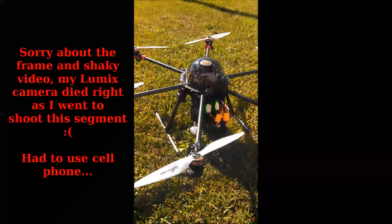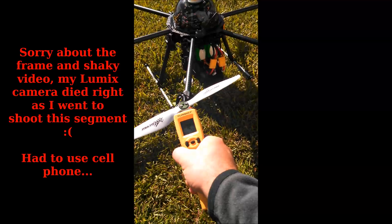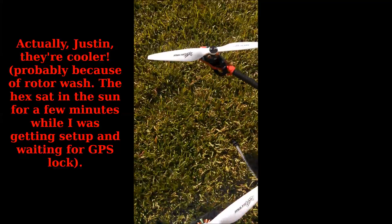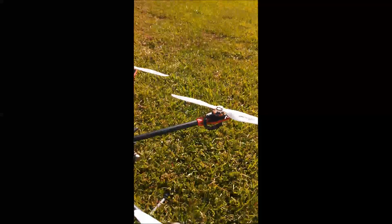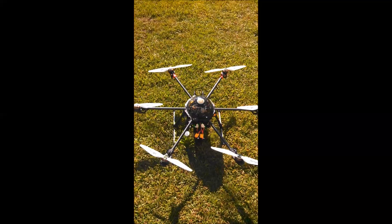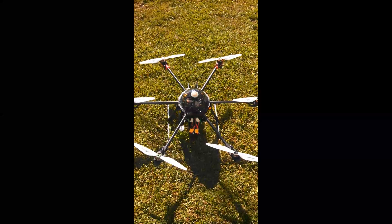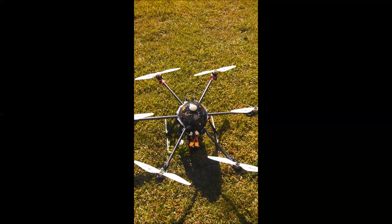We just landed. Total flight time was 10 minutes and about three seconds and we're going to go ahead and get motor temperature. It reads 74 degrees — they're literally the exact same temperature as when I took off. They're not warm at all, and it hovered smooth throughout the whole thing. One thing I love about these motors is when you spin them up and then disarm, they all spin down at the same time — no lazy motor indicating a bad bearing or anything. We'll go inside, find out the total draw off the batteries, and see how much battery it takes to hover for 10 minutes.